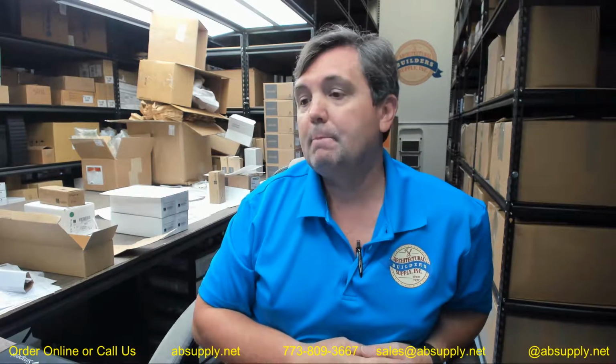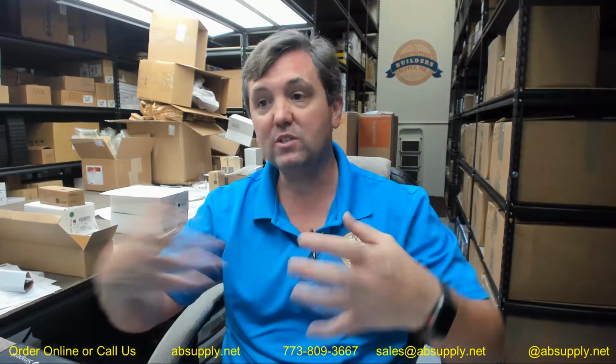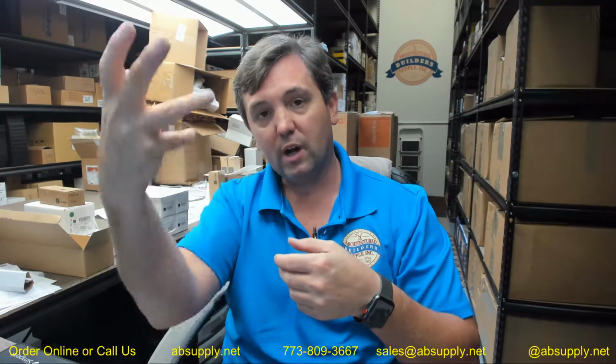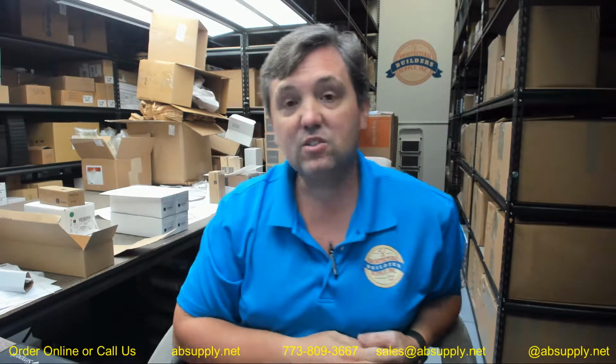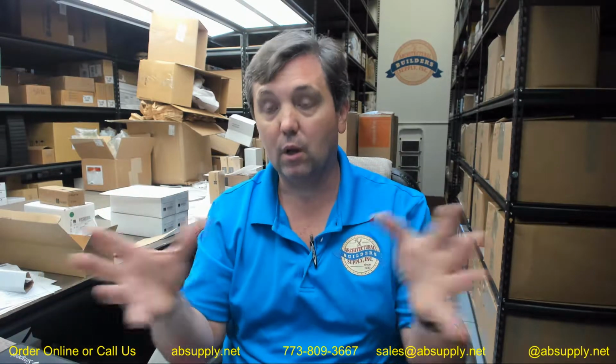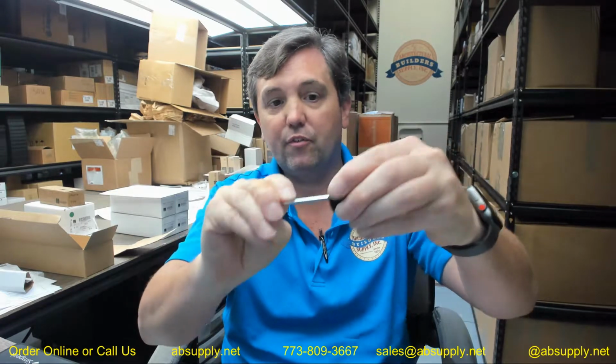A real great option for this could be an exterior door on a playground that you did want to hold the doors open. Recess is over. Push the doors open, hold them open, and then you just unthread it when you're done. Doors will close. Also has a dead stop feature in the sense that, again, as we talked, if you install the closer body and the closer arm to create a dead stop at a certain degree, that's where it's going to dead stop and make contact with that rubberized bumper. Okay. By the way, the Allen key is included for installation.